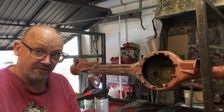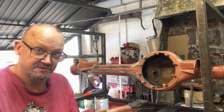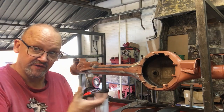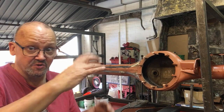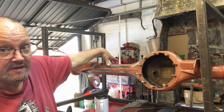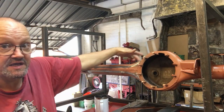Having said that, I think the XS 4x4 kit is similar in price to this, maybe slightly more expensive. There's not as much to it. You don't get anything for the undersides. It's all on the top of the axle. If you look at the Americans, they generally just do the top of the axle, but they put a huge truss all the way over the top, so you're making a huge box section. They're not just adding material from here to here.